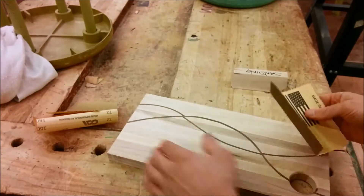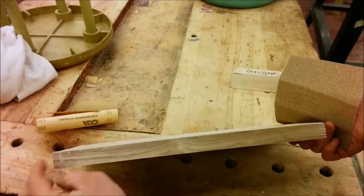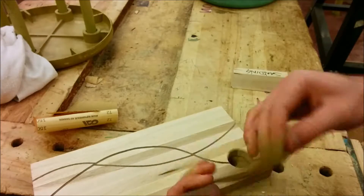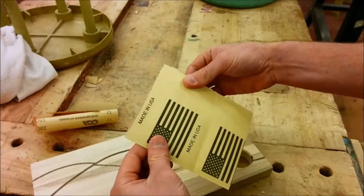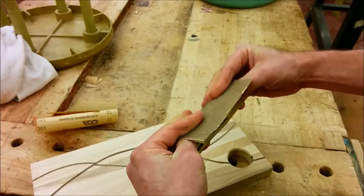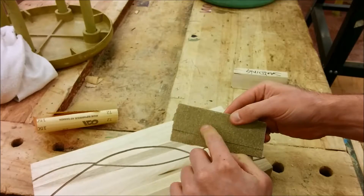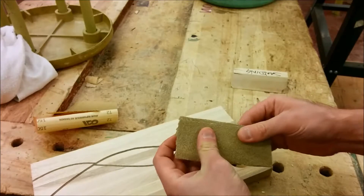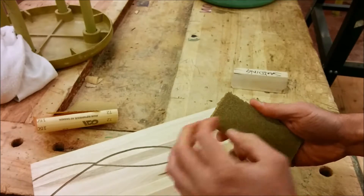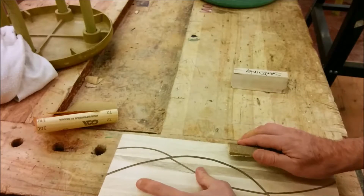We're going to round the corners. We're going to start with the ends first, then do the edges — every single edge, these corners on the bottom and top. I'm going to take the sandpaper, and with a new piece the best thing to do is fold it into thirds, like you're folding a letter. Fold it like this once, and then fold it again. That way I can use this surface, flip it over to use the next surface, and then flip it inside out to use the third surface — using the whole piece really efficiently. For rounding the corners, we want to curve the sandpaper while we're sanding in order to give us that rounded shape.